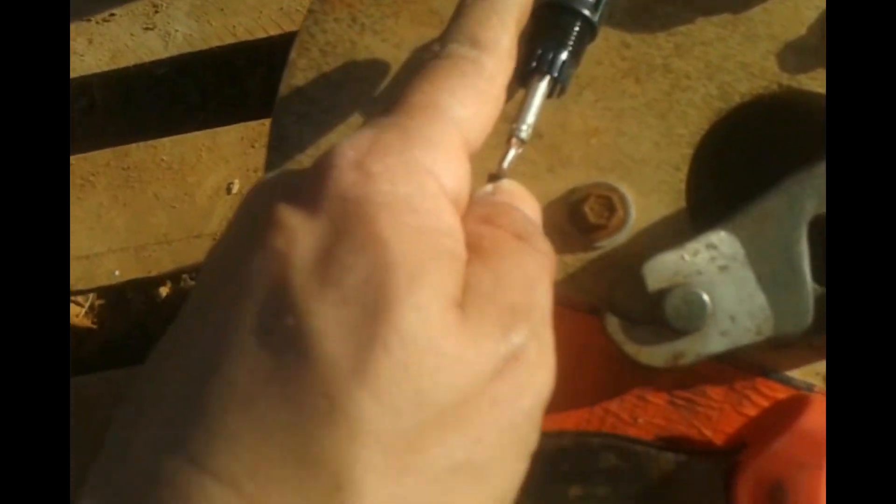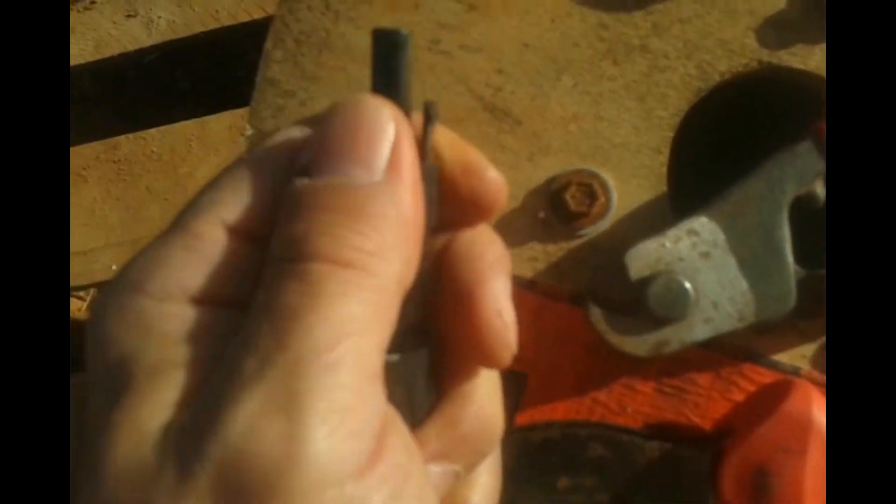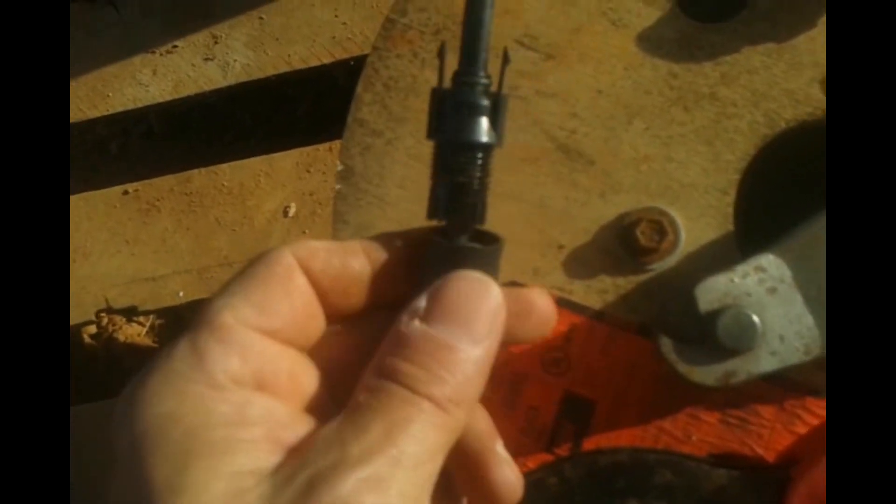This is going to be a little difficult, but to put in one of these ends on — they give you one of these pieces right here, you just connect it like that. And then I have a special crimp tool, but it's not necessary — you can use something else. Make sure you have this on first, because this screws in. And once that's on, you just slide that on and pop it on. I'm going to try to do this one-handed. See how it snapped in there — that's what you're looking for — and then just screw this on, just like that.